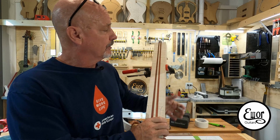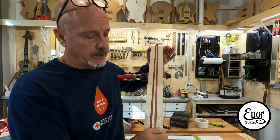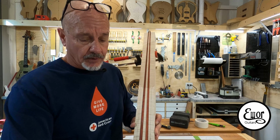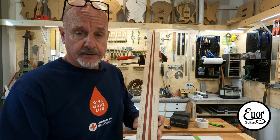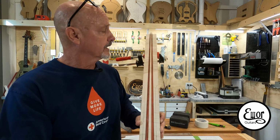I'm a little bit narrow. With the narrowest end, I'm about 2 1/4 inches. Way up here, I'm probably just a little under 2 1/4. And I'd prefer to have maybe 2 3/8 or 2 1/2 because I want to make this a square. This is going to be a square. The two outside pieces are going to be parallel for working on the rest of this neck.